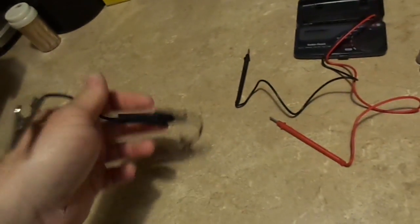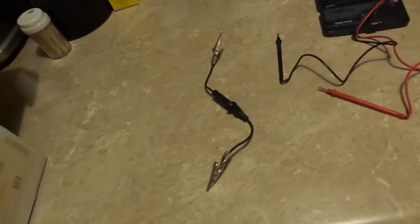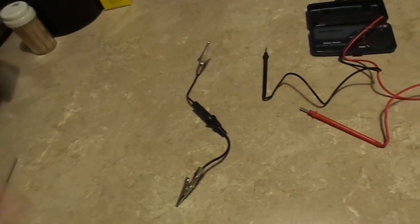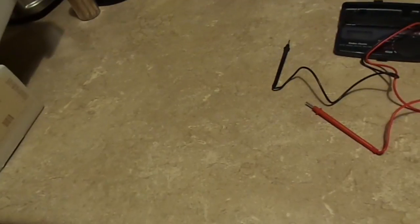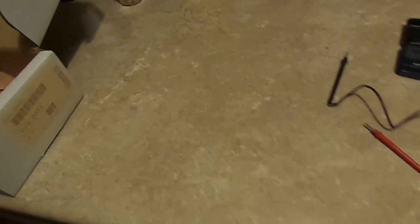This jumper lead is designed to ground the aperture, or the anode lead, to the chassis while it's disassembled. Electricity can — just like how a rechargeable battery can seem completely dead but let it sit on a shelf and the charge builds back up — it's for your safety to ensure it stays discharged. There are other capacitors within the chassis that can bleed energy back into the flyback and recharge it — not 100% capacity, but enough to give you a good shock.